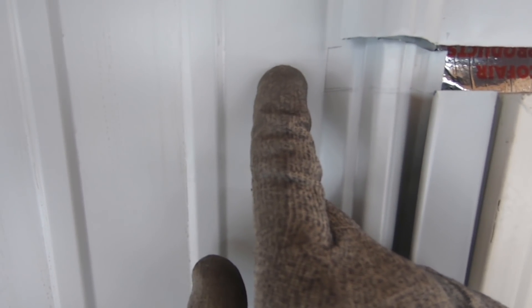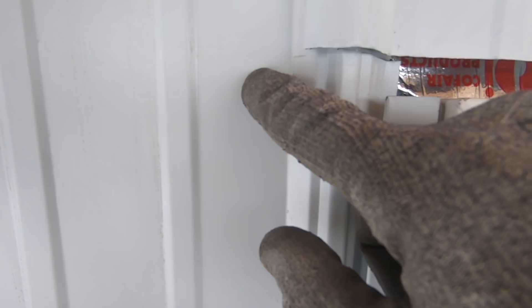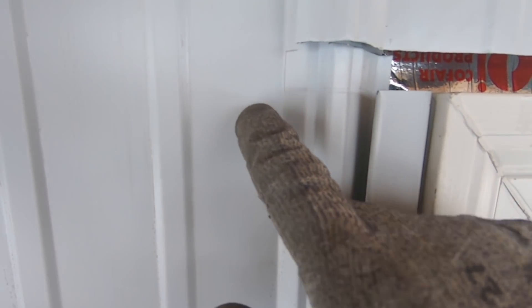I'm going to show you how to put your top trim on in a situation like this to keep water out. You can see I got this rib here, so I can't just notch this and slide my J-trim in because it won't go over this. So I'm going to have to cut this little section out. Once I cut that little section out, I can notch it over and extend my J-trim a little bit further. Then just use a little bit of caulk right here. I'll show you once I get it up there — I'm going to cut this whole little section out because my J-trim's got to come down to here but extend up past here.